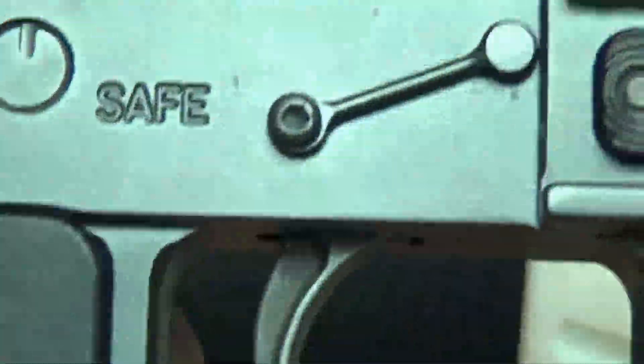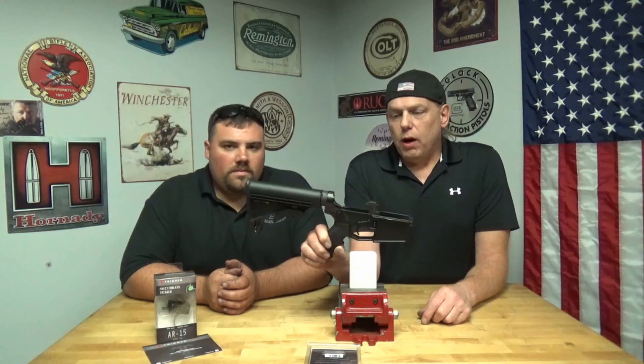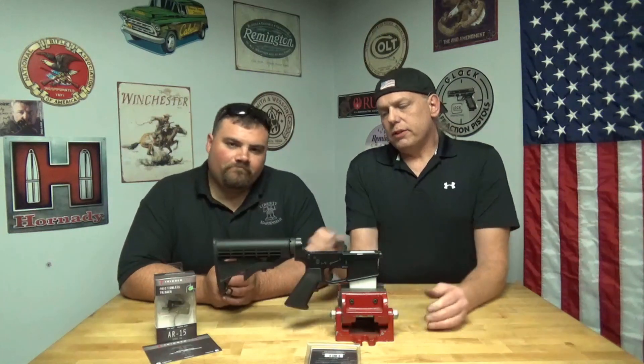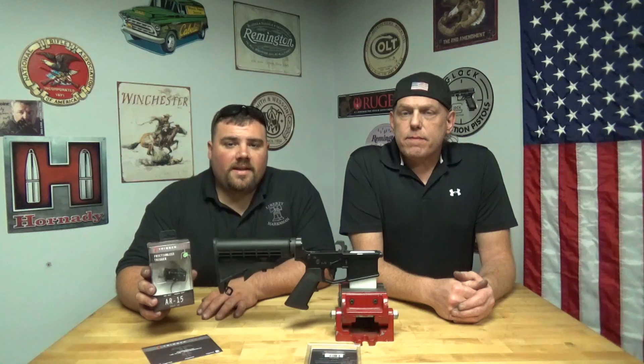It's functional and it looks cool — that's the K&S anti-rotational pin install. You can pick these things up for around $30, $35 max, maybe $25 on sale. The whole reason we did this particular lower is it's my Bumpfire gun — we've got 4,000 to 5,000 rounds through it, and we noticed the pins had walked out a couple of times causing trigger issues. It's also a 6061 lower receiver, a little softer and worn in, so I wanted to stop that. It's a must-have for drop-in triggers.